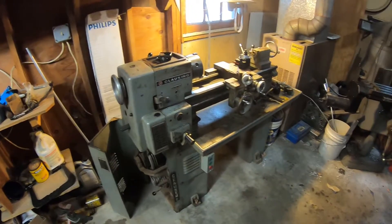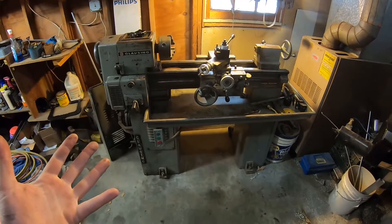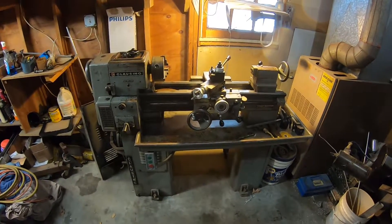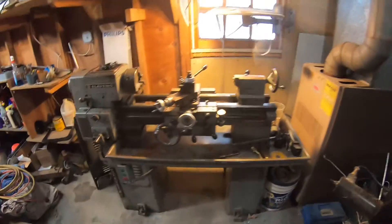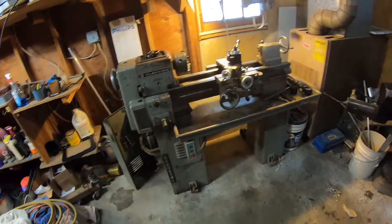Here's the thing that I think stops a lot of people from having equipment like this in their shop — the powering problem. This is three-phase, and so is the mill. The old way to handle that is a rotary phase converter, which is a big three-phase motor that converts single phase to three phase. The new way is a variable frequency drive, which has a controller and lets you vary speed by varying frequency — so you can change speed without changing the pulleys. Beautiful. I ordered one for this lathe but it isn't here yet.